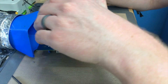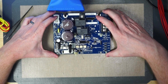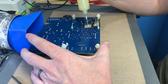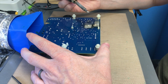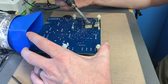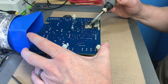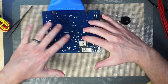Taking a look at the area where the thermistor connects, you can see it here — it has two large metal open spots on the board itself. We want to heat it up from the backside with our soldering iron, and I'm going to add a little bit of flux and see how this particular part of the board melts, and then we'll see if we need to use our hot air as well. I'm using my Hakko FX-888 with a big chisel tip on it. Holding it on there, it looks like it's melting okay but not the best, so it looks like it'd be a good idea to use our hot air.